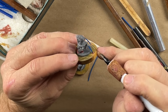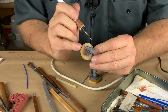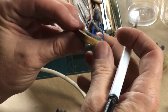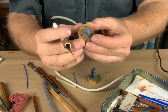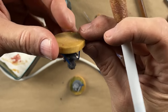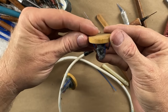You want to make a clean attachment point where the vent attaches to the part — the cleaner that is, the less you have to clean up later. You still have to cut off each and every one of those vents and clean each and every one of those connection points — there's no getting around it. So now I'm just looking at this piece wondering if that's all I'm going to need with respect to vents. Hold it upside down because that's how it's going to pour and cast.